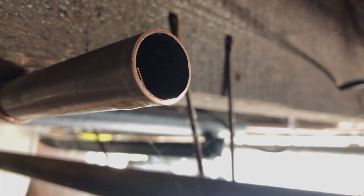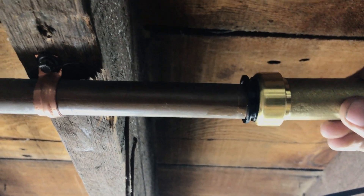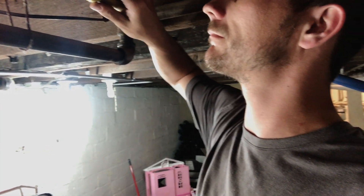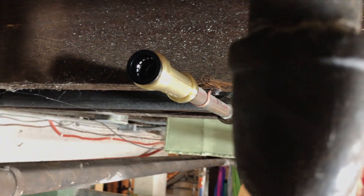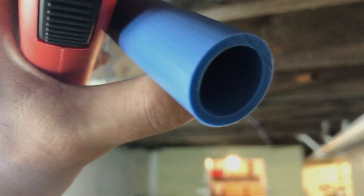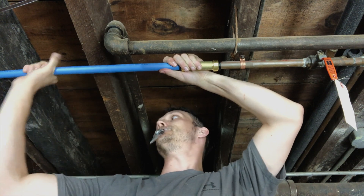You can see we have some burrs on the inside of the copper pipe — we want to take our tool and ream those out. This ensures a cleaner connection and helps smoother flow through the inside of the pipe. Then we are ready to install the push-to-connect fitting and we're just going to slide it over the copper. Once that is done we're ready to connect the PEX. When we cut the PEX we want to make sure that it's long enough so that it gets past those teeth and into the rubber grommet so it has something to seal to. We want a nice perpendicular cut, then we're going to take this little piece and slip it inside the PEX — this is the piece that ensures those teeth bite in there without crimpling the PEX. And lastly, we push to connect.